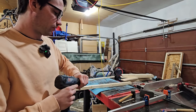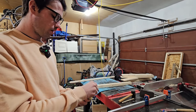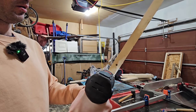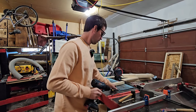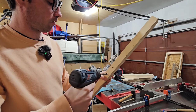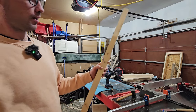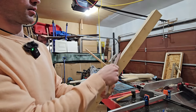Something else you can do with this though — I personally prefer, if I'm going to use screws, that you cannot see the screws. So by taking it, unlocking it, and dropping it as far down as I can, I can pre-drill my hole. But this time there's a much deeper hole. When we mix that with a screw placed into the hole, we can take a dowel — generally you'd use some glue — and put your dowel into the hole. Then taking a saw, you can just flush cut your dowel.